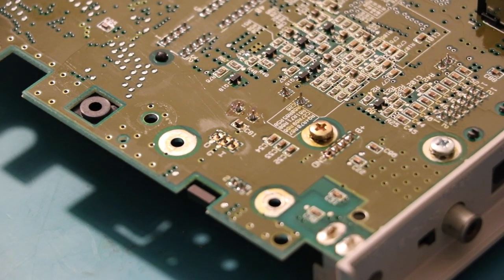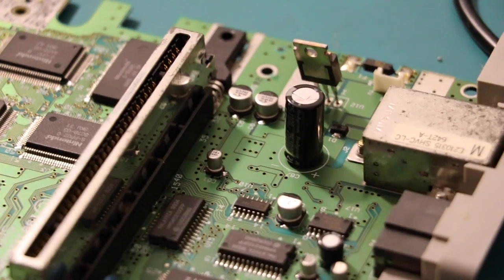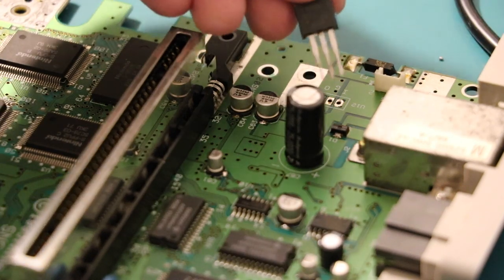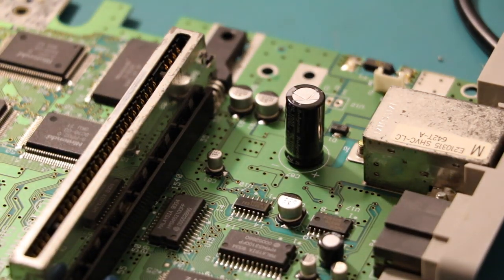Trying to think what the last thing is I would have desoldered. It was something with 40 pins. And if we flip that back over and find our focus, this little guy should just... Look at that. Look at that. Just beautiful. I love this thing. Whew, smells like old solder. Extra lead.